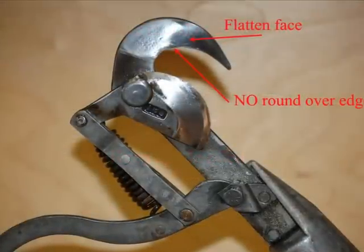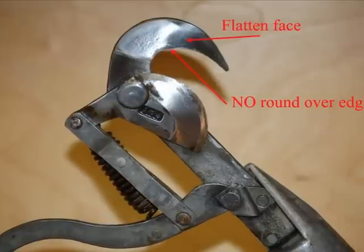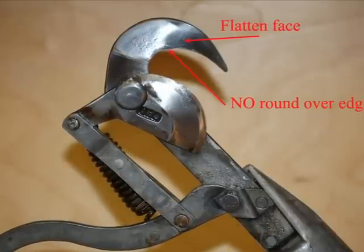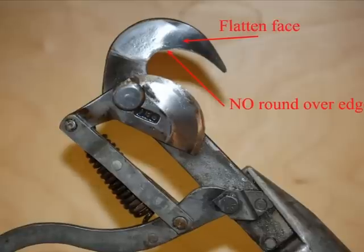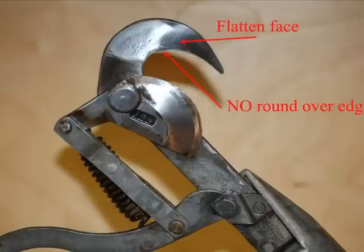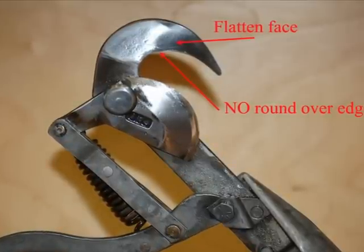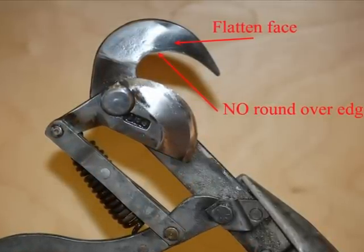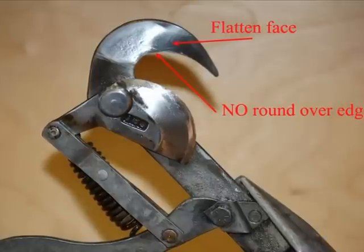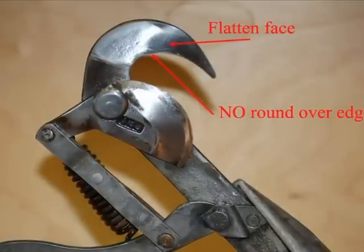As well as both of the faces that touch each other being clean and flat, the blade itself has to be maintained sharp. You don't want to sharpen it to too steep of an angle, otherwise it gets dull too fast. You don't want it to be too abrupt of an angle either. It's quite easy to maintain with a flat file — just a few strokes every day will keep this up and that will make all the difference in the world.